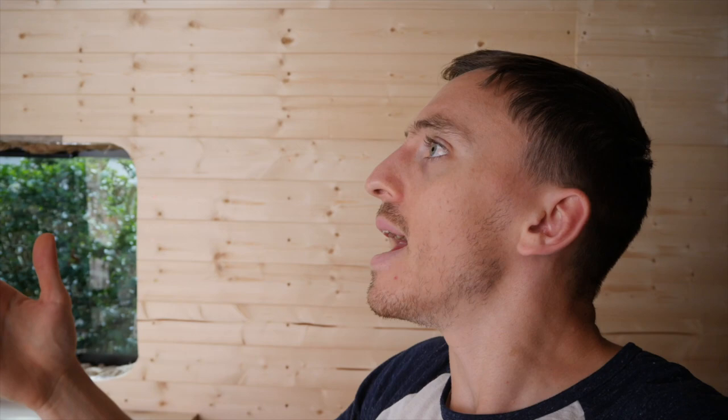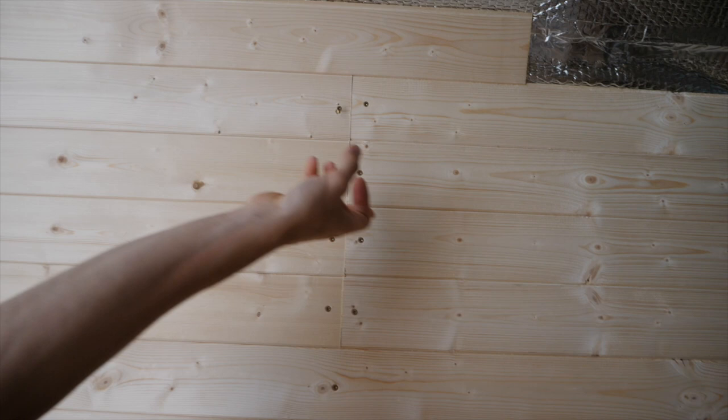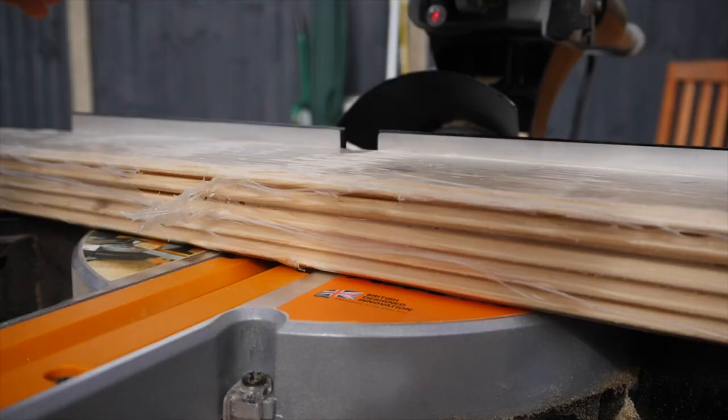What I'm going to do is lead them from the front to about this rib here and then take them from the back as well, and I'm going to stagger them so that the split is staggered. Instead of them all coming to one rib and meeting — like on the wall here you can see they're not supporting each other — when the split is staggered at different intervals that's going to make the whole structure a lot stronger.